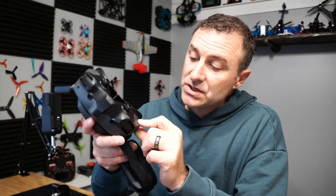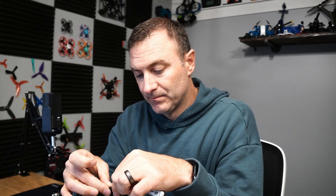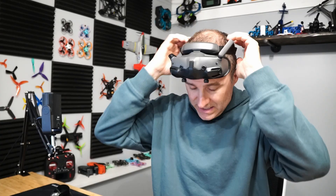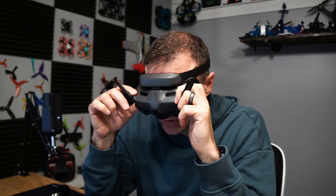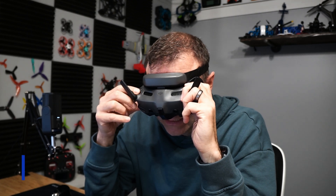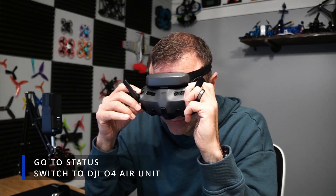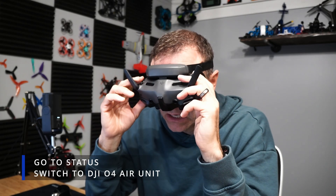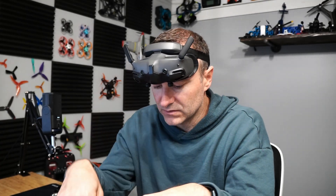Now I need to connect it to my goggles. I'm going to power them on — tap and hold to turn on your goggles — and I'll need a battery to connect my drone. Inside my goggles, I need to make sure I'm on the right mode and set it to the DJI O4 unit. In the basic menus, find DJI O4 and tell it that's what you're looking for. I'm going to go to status and switch to my DJI O4 air unit. It'll make that switch, but it's not going to connect right away — I have to pair these goggles to this air unit.